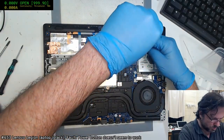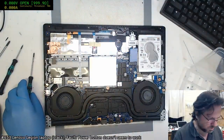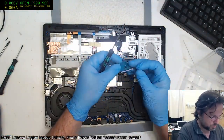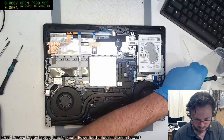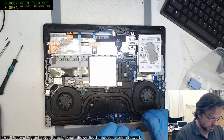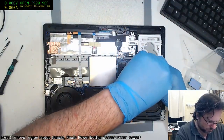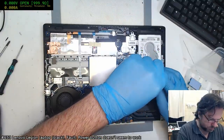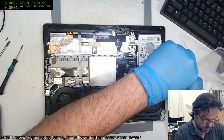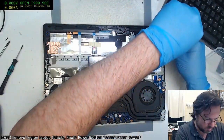Of course, you know this is not going to be a simple, easy search. Yeah, this will be the other SSD. This is that kind of half or one third format SSD. Can't say I'm actually a fan of it. First thing that comes to mind is that due to the lack of chips being used, you can expect probably a higher wear.